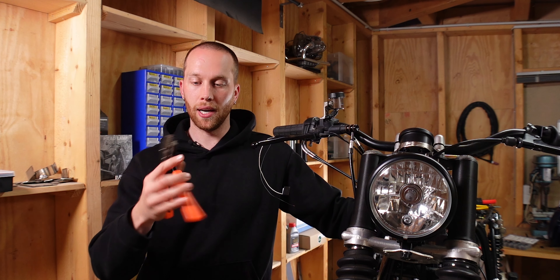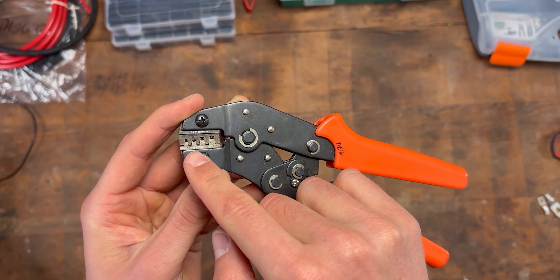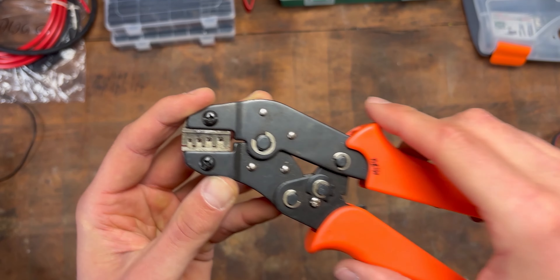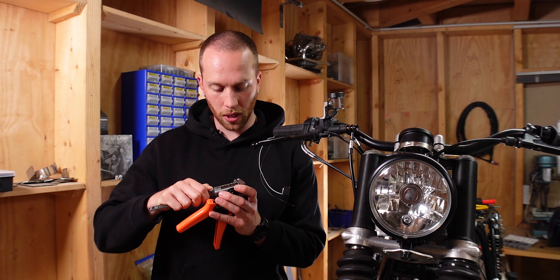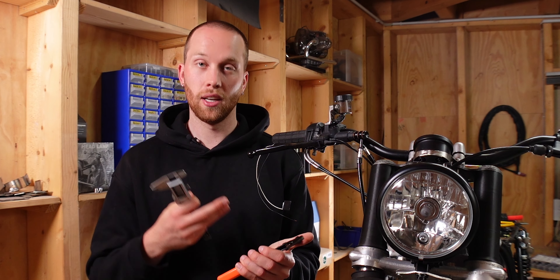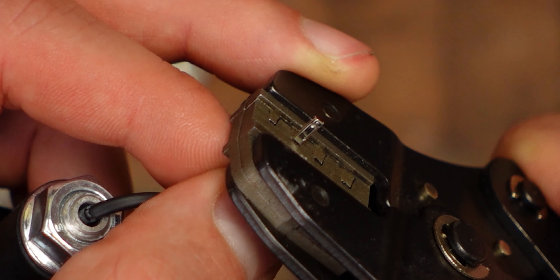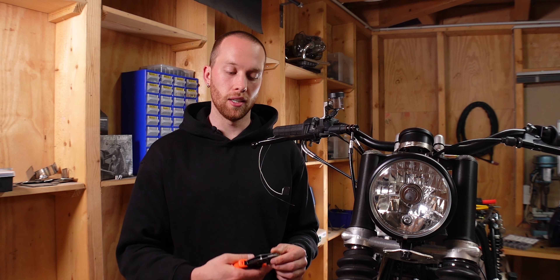You'll also need a fitting pair of crimp pliers. I have a generic pair that actually works for these crimp connectors — it has relatively small openings but the same shape as you'd use for regular ring terminals. The opening I use for the Miso connectors is 2.35 millimeters. I can't link it since I bought it years ago and it has no labels, but if you find one with that size it works. The official crimp pliers would cost around 450 dollars, which is ridiculous for just two indicators. Do a few test crimps first, and get a few extra crimp terminals so you can experiment.